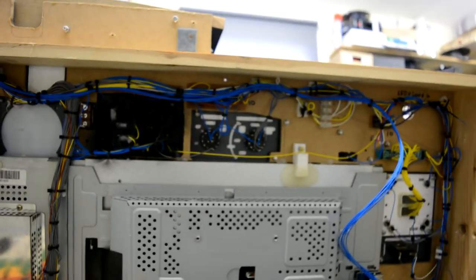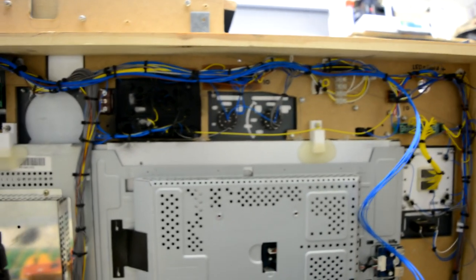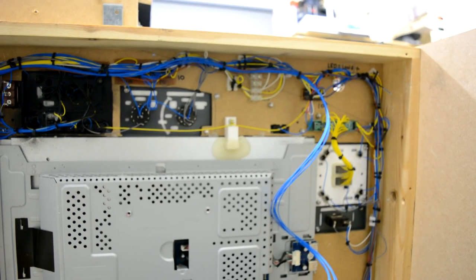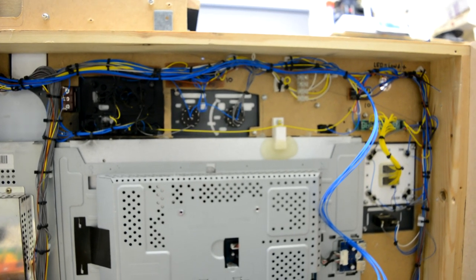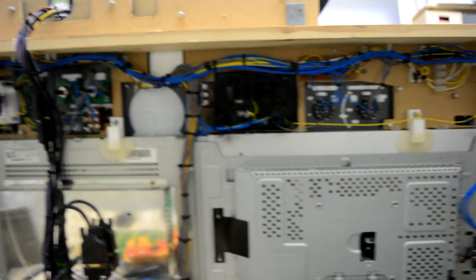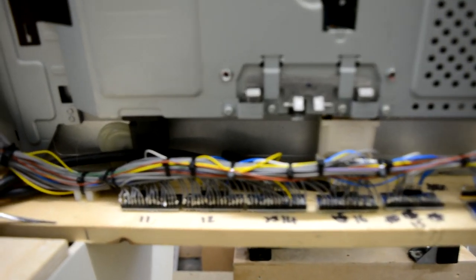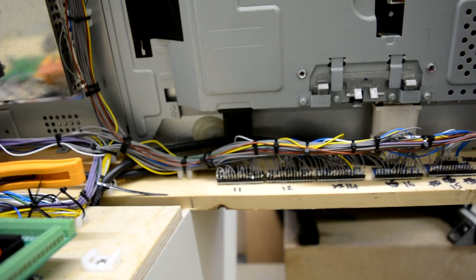So I get a lot of questions saying, how can one Arduino run a whole cockpit? Well, that's how. Breakout boards, like I said, 64 LEDs from one pin. So for the overhead, for example, you're probably looking at two Arduino pins for the whole overhead, LED wise anyway. And then obviously the buttons all run through these multiplexers, so again, that's 16 buttons from one Arduino pin.